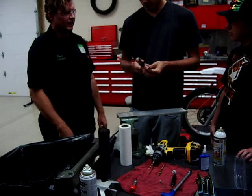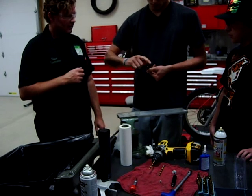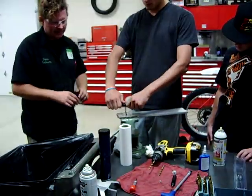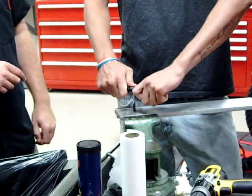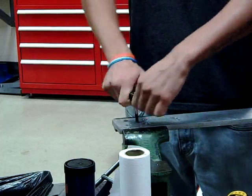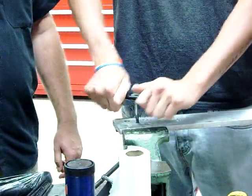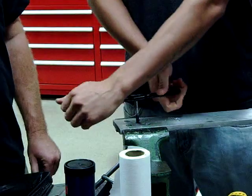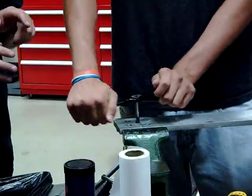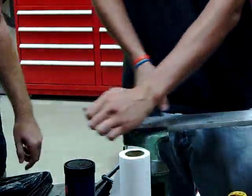This adapter comes with our kit, with our Snap-On tap and die kit. Now what he knows — he's been training on this already — is that he's going to apply a real good even pressure straight up and down so that he doesn't start to tap that hole at an angle. Looking good. If he was feeling like it was really stiff or hard to pull that tap through there, he could stop and go back and forth, basically rocking it to pull some of that debris up into those channels.